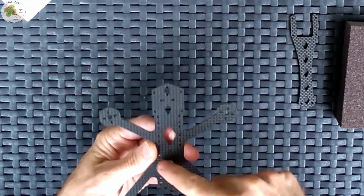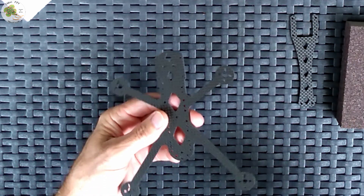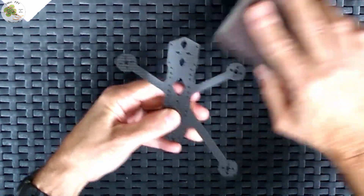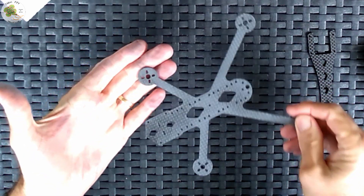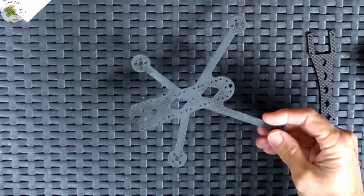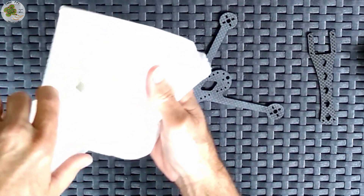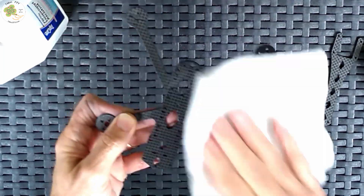Now let's start prepping the frame for its base coat. I just want to scuff it up enough to get the glossy look off the base plate. You don't have to do both sides if you don't want to — if you only want to do the part that's visible after your build is complete, that's up to you. For this one I'm gonna do both sides. See the dust that comes off in your hands? That's what you don't want to be breathing. It might make sense to wear some gloves, and this is also the reason I've got the isopropyl alcohol — we're gonna use some to wipe it down and get some of the dust off.